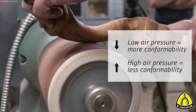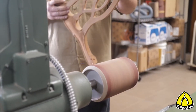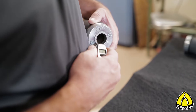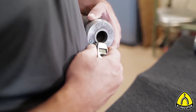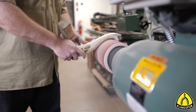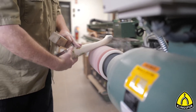To achieve the best result from the inflatable pump drum sander, it will require the best combination of bladder pressure and pressure put on the workpiece while sanding. Too little pressure on the workpiece will not allow the sander to conform to the contour and will not allow the abrasive to cut as it should.